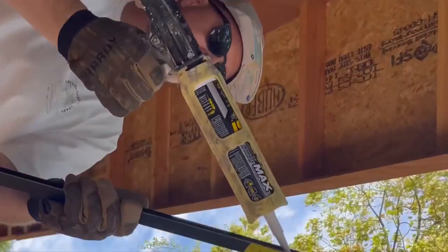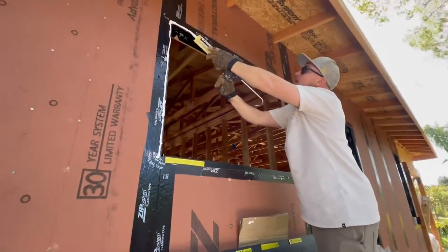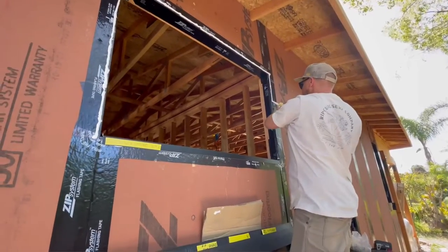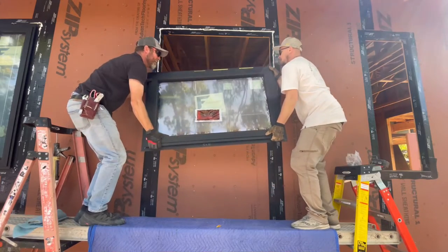This is the Fleetwood pan — all aluminum. This is what the Fleetwood windows come with, and we are going to seal it in place. We're placing the sealant on the underside of that pan — that is what Matt is doing now. We're using the Quad Max. Love that sealant. We also use a quad sealant on many windows, but the Quad Max is just one step above. However, there is a supply shortage on the Quad Max — if you go into Lowe's or Home Depot, at least in our local area here in Oceanside, San Diego, they are out a lot of times. So we had to go with a white versus a darker color sealant, and that's fine.